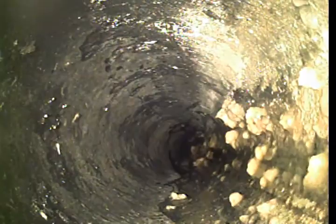Definitely recommend hydrojetting, though. And that water that's holding in here is also the issue, because back there, the grade. When you're looking here, you see a tiny bit of water. So it could be affecting it all the way down the line. So it's interesting. Let's look back at the photographs and see how they joined those parts. It might have been a rubber coupling.